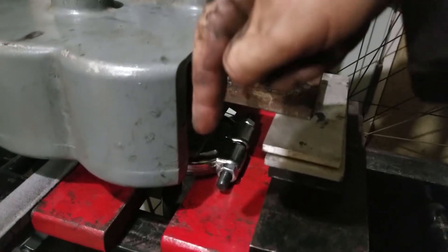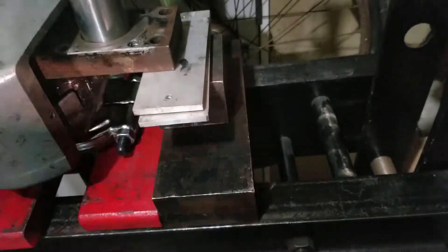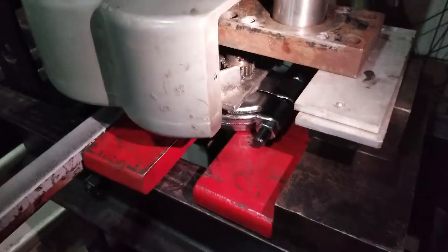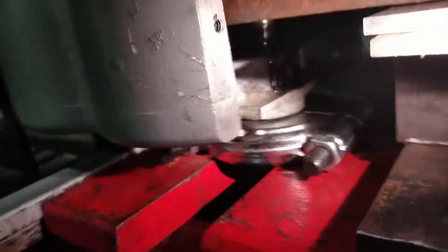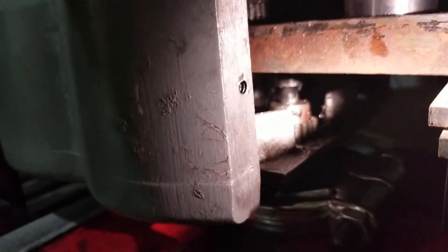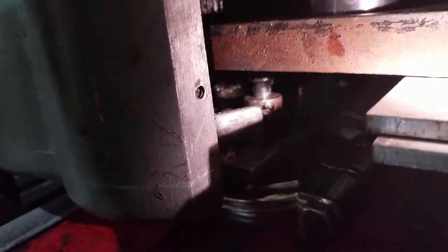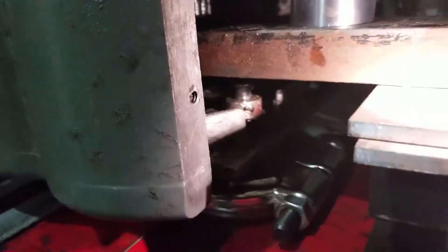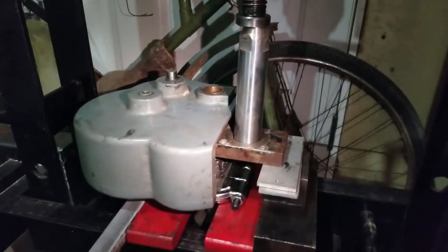Essentially, this part won't move so the only direction is down — it'll push down on the inside of the shaft while the red pieces support the case and hold it up. It will push the shaft down. Let me try as I'm filming — pressing now, shining the light on it — and it actually pushes it down! I don't want to go further yet because I need to support the cutter head so it doesn't drop, but man, I didn't think that would work — but it did.